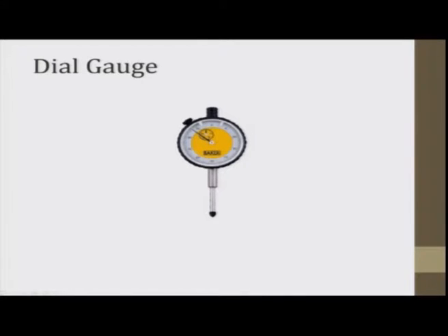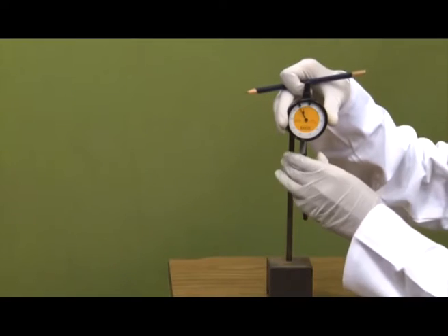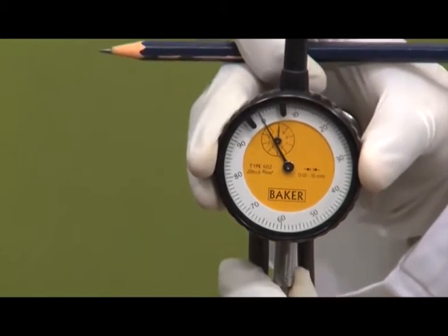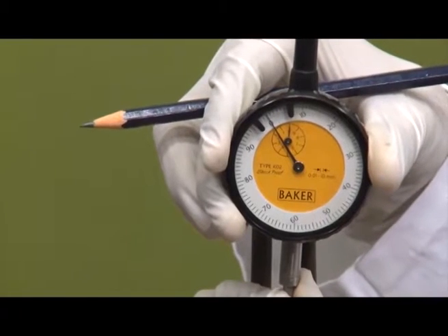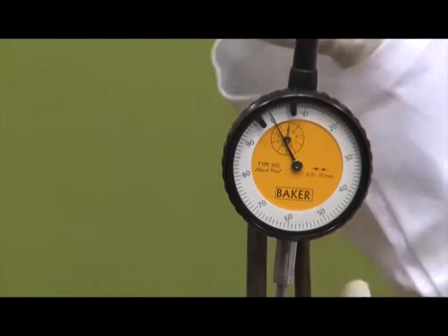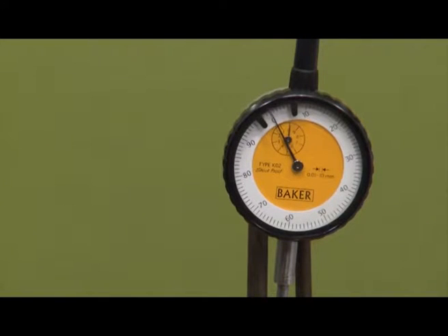The first component is the bezel. The bezel is the outer part which can be rotated to adjust the zero. So this bezel can be used to adjust the zero — if there is a zero error, we can adjust it here. We also have two markers visible in black color. These two markers are used to mark the reference point and for the start of measurements; they are generally kept at the reference point, or one of the markers could be kept at zero if required.